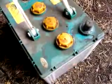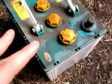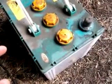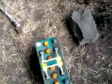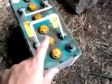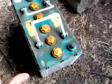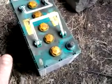the negative and the positive will drop quite a lot, and I used to have the negative, even though these aren't in series, they're in parallel, otherwise it'd be a 24 volt system, and I believe that charge controller is actually a switchable 12 volt 24 volt, and it'll detect whatever the batteries are to work out if you're running a 12 volt system or 24 volt system. It just does it automatically. But you'll notice that your negative and your positive goes down. And even though I'm not running them in series, which would make it a 24-volt system, I'm running in parallel.